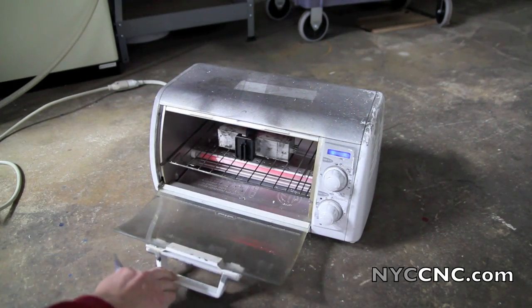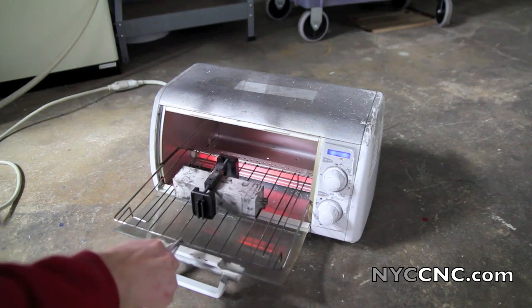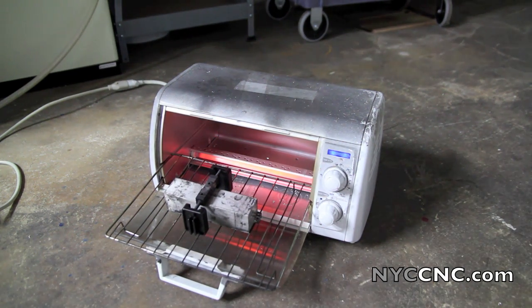The part's just finished. I'm going to open up the door and gently pull them out. I like to let them cool just like this — they'll cool a lot faster this way than if you leave them in the oven with the door closed. I also don't think it's the best idea to take them out and put them in a cold place or blow a fan on them to accelerate the cooling. They're just fine to air cool and it'll only take about 20 minutes. This is so much better than wet paint or spray paint, but it does still smell a little, so I like doing it in the garage where I'm away from the rest of the family. You also can't use a toaster that you use for food — so don't do this in the kitchen oven.